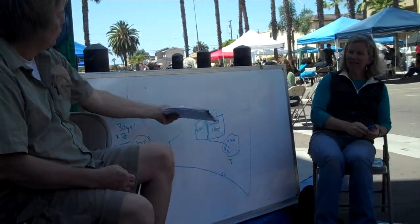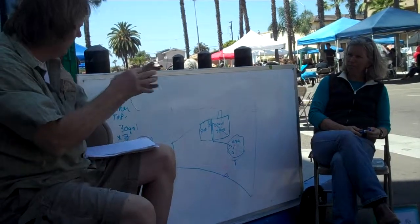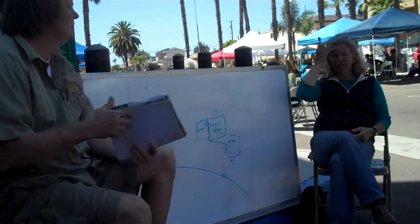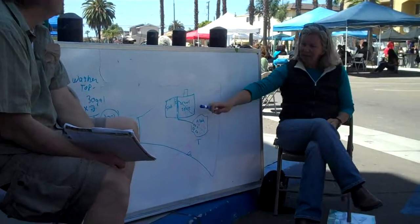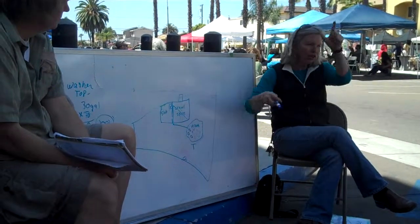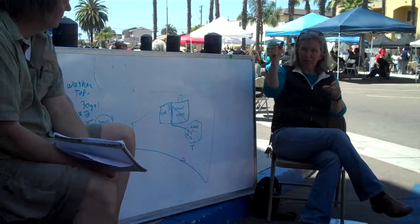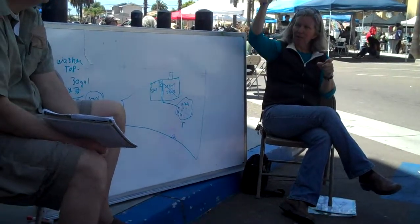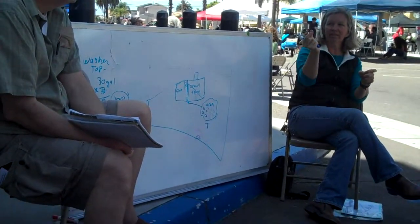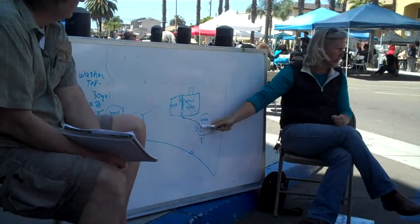When you run a washing machine, the water that comes out, is there like fibers in it from clothing? Well, yes, there is. And a great thing about this system is this is a 1-inch PVC and a 1-inch poly line, so you're not decreasing the size of it. And when you make your turns, instead of making a sharp turn like a 90, you want to use a 45 and a 45, so you're allowing the water and the lint to move through all of those corners. And so we would do that on all of these.